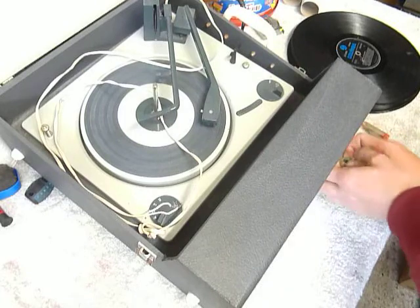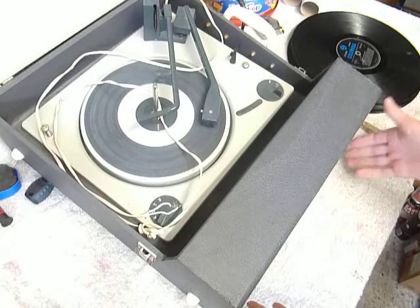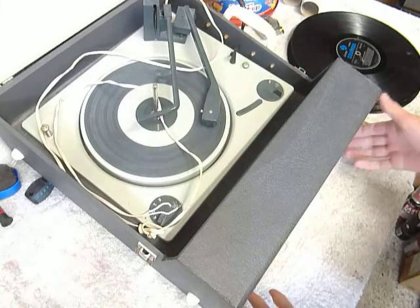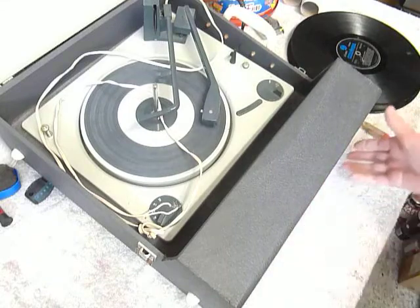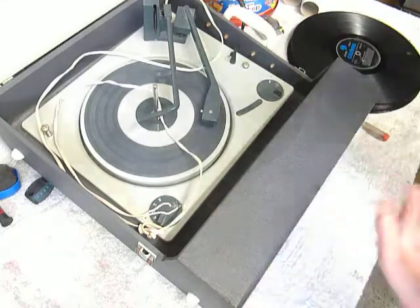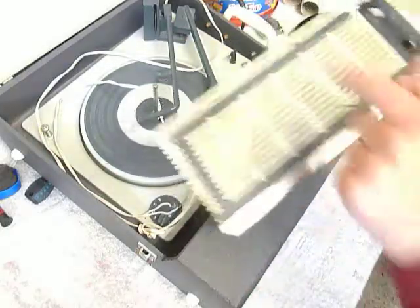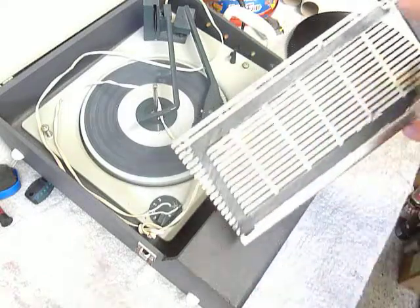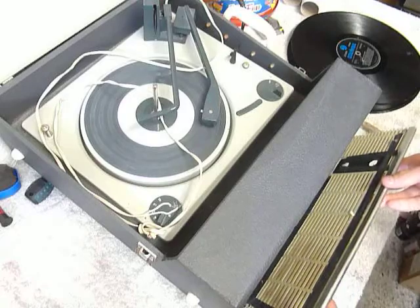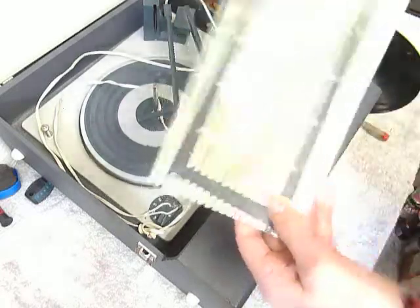Pull the knobs off the front like so. The grill is only held on originally with double-sided adhesive. If you've got a hairdryer, heat it just for 20 seconds or so and it'll come loose and the grill just comes off - simple like that. You can see this is all the original tape on this one. It just goes straight back on; there'll be enough adhesive left on it to stick it back on after. I never stick them on too firm for the very reason that if you need to get inside to service the amplifier, you have to get this off.